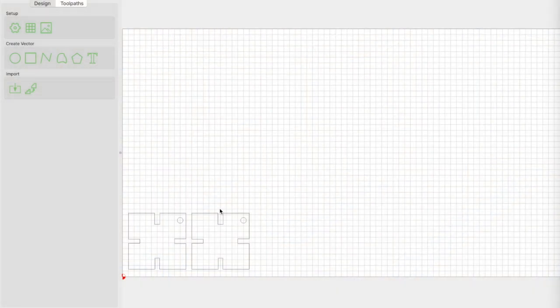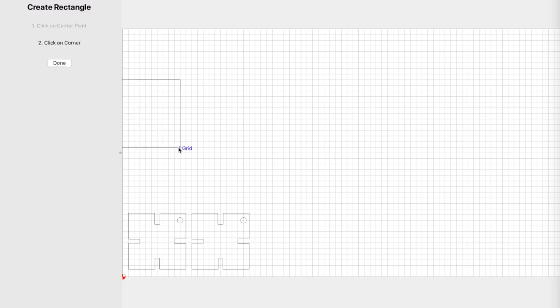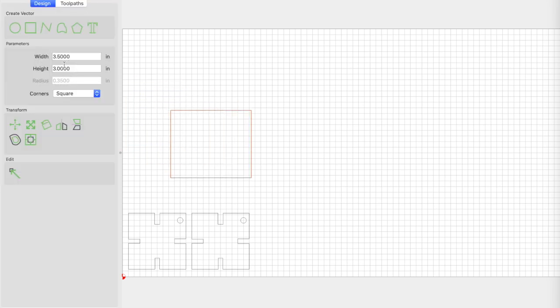Let's talk a little bit about the frame. If you're going to do any kind of tab and slot connections like this, it's always a good idea to make some test pieces to make sure you're getting the fit you want. These test pieces are just a set of identical squares where you can test fitting different slots together. Each slot going clockwise gets a little narrower. You just start with a square and create a rectangle — in my case starting with 0.23 wide and a height of 0.5 inches — then use subtraction to create the slot.